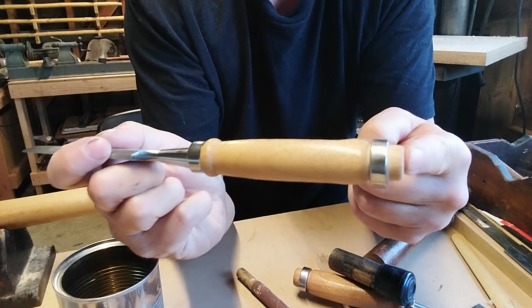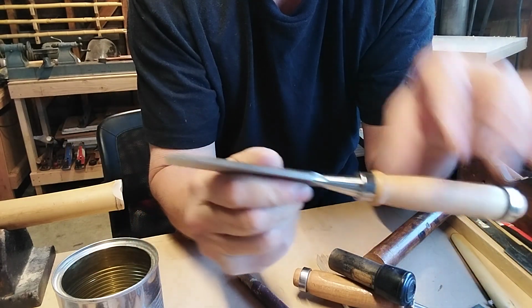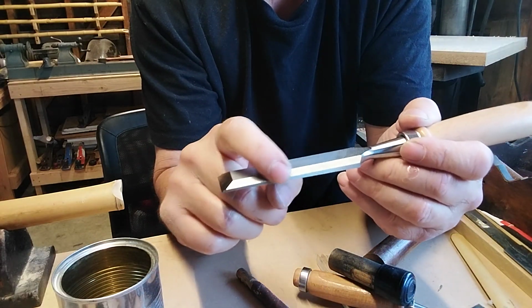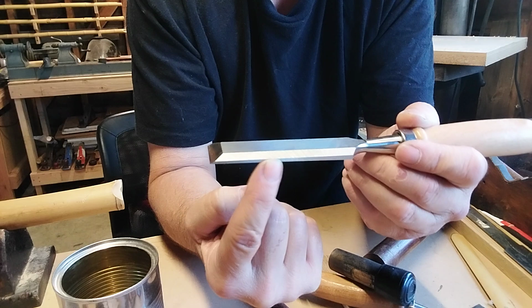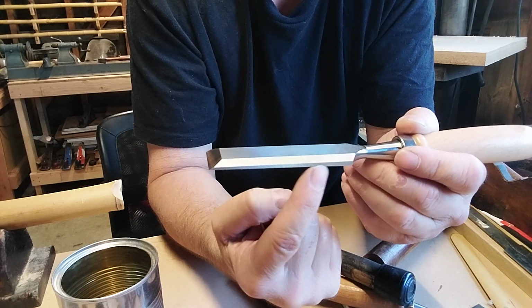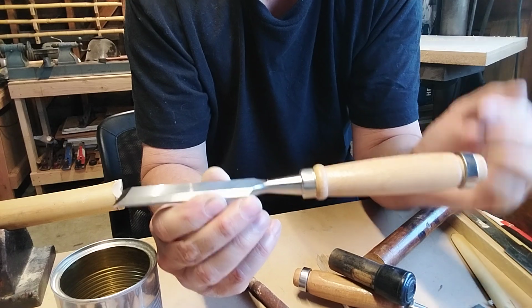Same thing, just like this, if you want to take this off and make it modern, you can cut that off with a thin curved saw. If you only do dovetails and you want those bevel edge, expensive Nielsen ones, you can use a grinding stone, a file, a belt sander, whatever, and bring that down. You do that yourself. You customize them. These are designed to be customized by the end user.